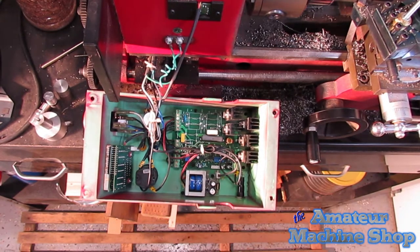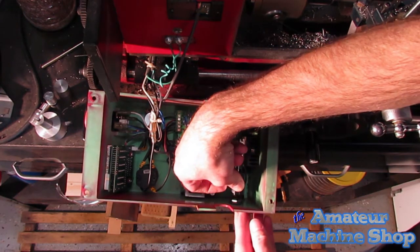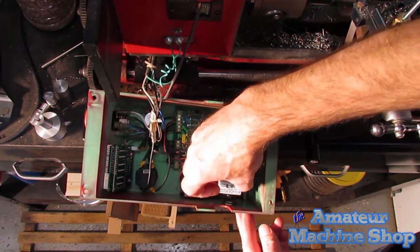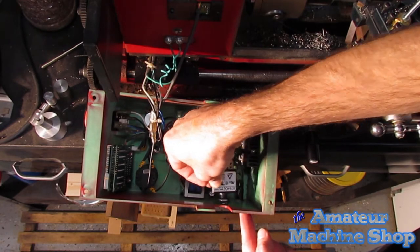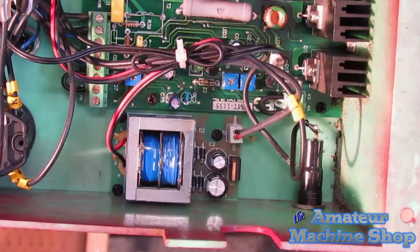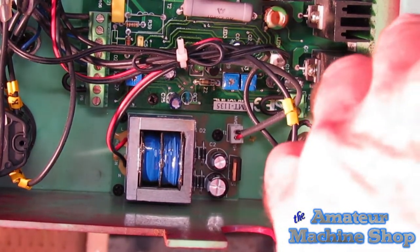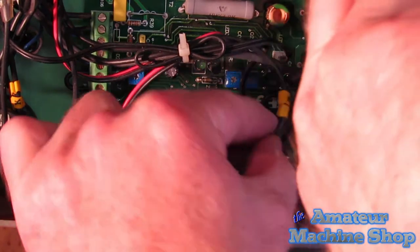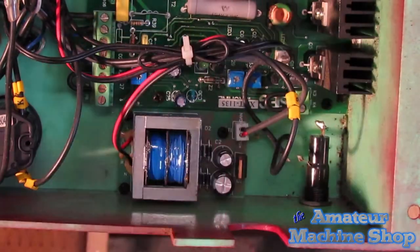I did a dry fit of the circuit breaker to get an idea roughly where I could mount it without interfering with internal electronics. Here's what I did to mount the circuit breaker. First, I snipped the 2 wires from the fuse holder, then cut and stripped both of the wires for the 1/4-inch female connectors. Once the wires were ready, both connectors were crimped to the wires.